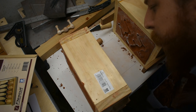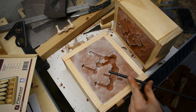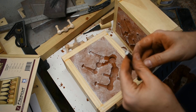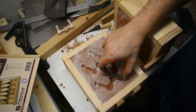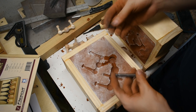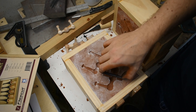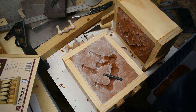Just to be careful, I'm going to feed another one over there. Obviously I can't put the wood back in there, so I have a backup plan — this piece of metal rod, which is now way too long. I have this piece of very hot metal rod — ow ow ow — I'm going to set that down for a minute. The idea is I set it down in there and the metal pours around this and hardens onto it. However, the book suggests rubbing some charcoal on it so there's a graphite coating, and that will allow it to release a little more easily. That's either sufficiently carboned up or it's never coming out. Ta-da! And that's how a core works. Sort of — there will be a lot more on cores later.